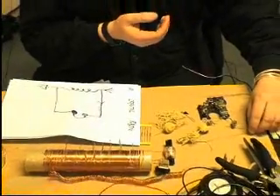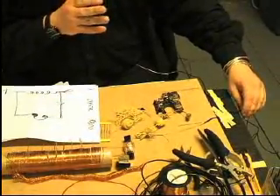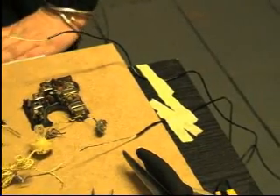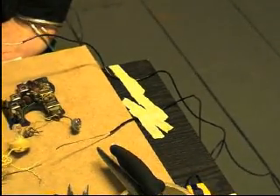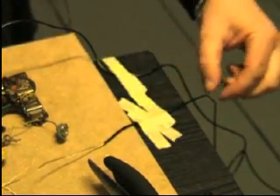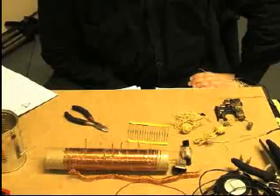What we have here is the earthing wire, which also should be quite long. The earthing wire is connected to a water pipe. There are two reasons for this: first, because it's part of an integral system of pipes, the electrons — the energy — when it wants to be released, it can go down through this wire, and when it reaches the pipe it has a good scope to disperse its energy. If you're outdoors and don't have a cold water pipe, you can draw this wire away from the main crystal radio as far as possible.